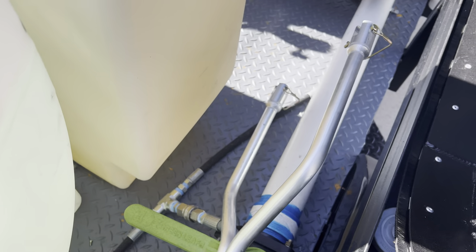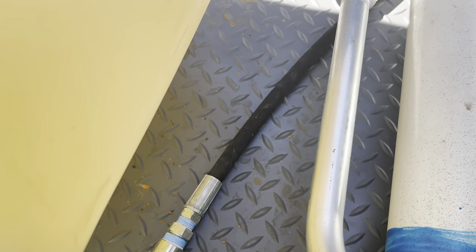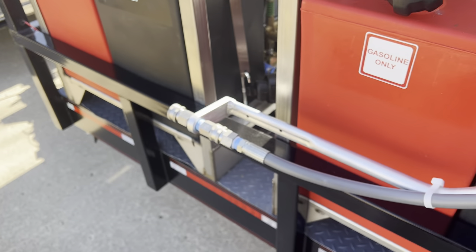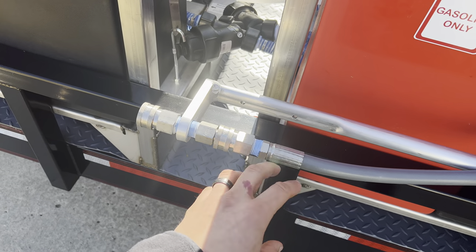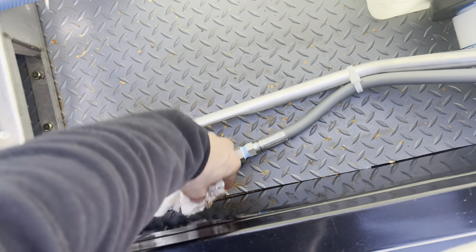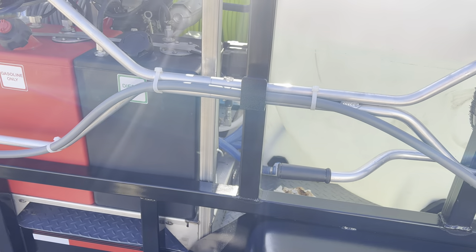I've modified both surface cleaners. The bar for the Mondo uses half-inch fittings going into a half-inch T, scaling down to the hose. Instead of a handle I use a ball valve as my on/off. If the hose busts, I disconnect, replace the hose, reconnect, and the surface cleaner is operational again. The Mondo also has a 25-to-35 gallon-per-minute filter on it.